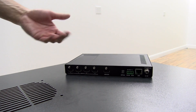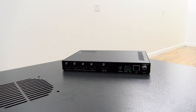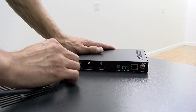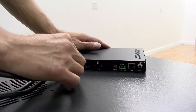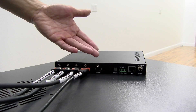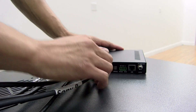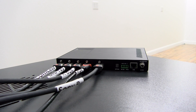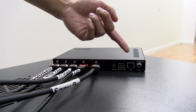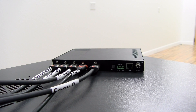We are looking at the back of the Juno 451 and we're going to connect our HD sources to the four input ports. We'll start with the Comcast cable box at port one, the Blu-ray player at port two, our Xbox going into port three, and a PS4 at port four. Next to that is your HDMI output port which connects to your TV. Next to that you've got your optical port for sending audio. You also have your RS-232 and IR port for any third-party control systems. Next to that is your LAN port for connecting a network switch or router for Ethernet, TCP/IP, or Web GUI. And lastly, our 5-volt power supply.